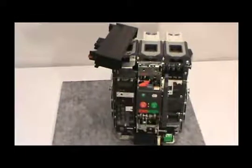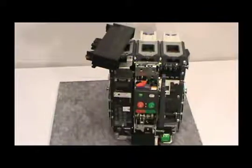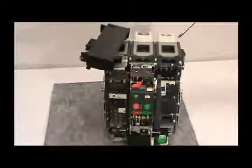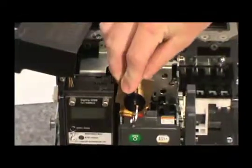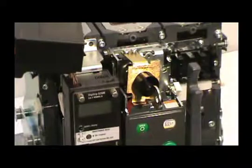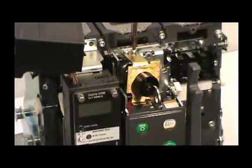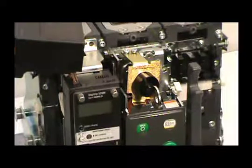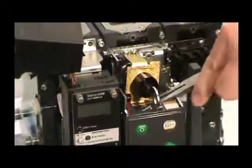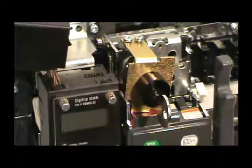We have removed the front cover, shifted the secondary mounting bracket, and assembled the key lock. The last phase involves mounting the key lock assembly to the circuit breaker and ensuring it is functional. Locate the mounting location just below the secondary mounting bracket — there are two threaded mounting holes in the mounting tab. Using the two mounting screws and two fiber retaining washers, screw the key lock assembly halfway into the mounting location, then stop. Before firmly securing the assembly, use a pair of pliers to pull the plastic push button plate out so the bracket's sheet metal tab slides in behind it. Once the metal tab is behind the push button tab, finish tightening the mounting screws.